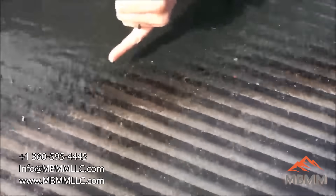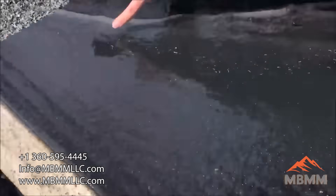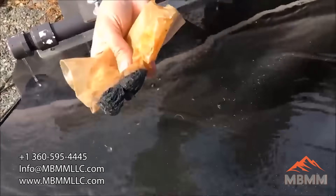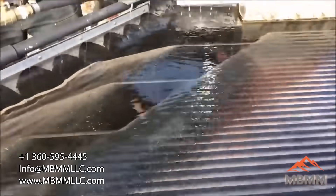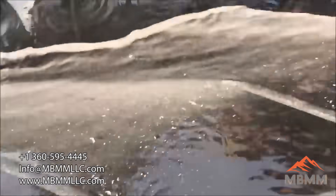Down below the ferrite, this is probably aluminum or your lighter base metals. And the copper wire, surprisingly enough, has such a messy surface area that it won't settle down into the grooves with the ferrite. So a lot of your fine copper wire is coming down into your number three middlings, and your finer copper and some of your pins are coming down into the number one and number two mix. We're actually getting pretty good separation on the table. One advantage of the ferrite is it is magnetic, so you can pull it out with a magnet fairly easily. You're getting really good separation of the dense heavy base metals — either lead or tin — and the aluminum is separating very nicely.